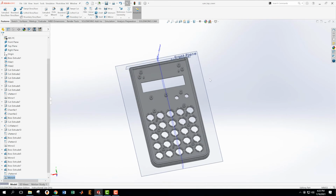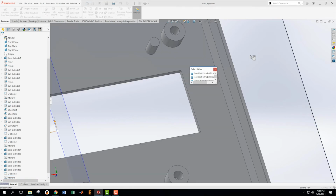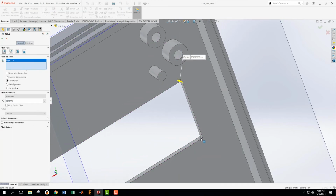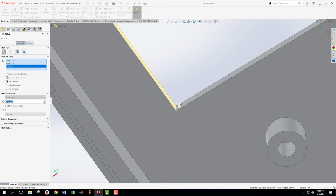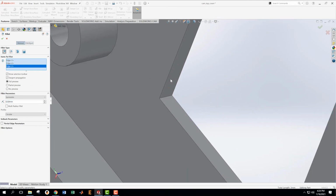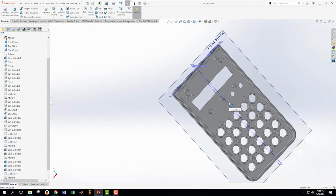I also was looking at the drawing and noticing something I had sort of forgotten, and that is that the inside corner of this window has a little fillet in it on this edge. Oops, not that edge. Let's actually go up to our fillet command. This corner, that corner, that, not that corner. Delete. That one. And that one. And the value of that is 0.5, just as we have it already. Okay, so that was a little detail we needed to take care of.